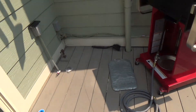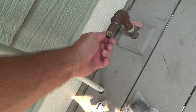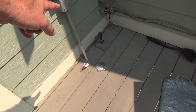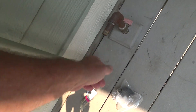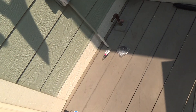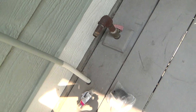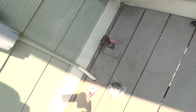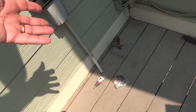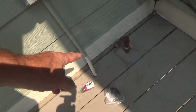If I ever left a gas line open like this, it's really not a good idea. If you're not going to use your gas, go ahead and put a cap on there — get your Teflon tape and put a cap on the end of it. Even though you have the valve off, in case somebody turns it on by accident, or your gas valve gets damaged, you don't want a leak. And if you get bugs or ants making a nest down in there and then you hook this up later, it's gonna get all messed up in your regulator and your regulator's not gonna be working properly.